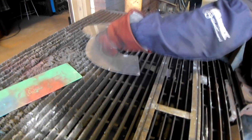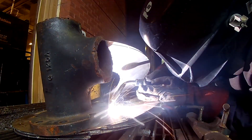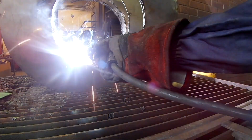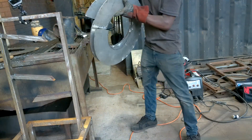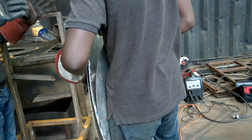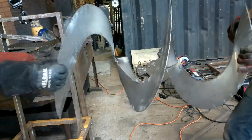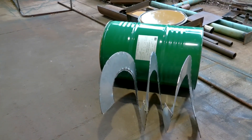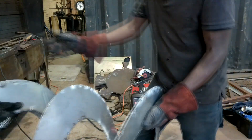At this point I'm pretty much welding all of them together. Once I got all the pieces individually welded up I started putting them together, using an old pipe flange to hold one side up while welding the bottom — this stuff is like a spring, it wants to compress until it's stretched out. I had my buddy help me stretch it; the professional way is probably a hydraulic tool but I've got my own hydraulics — arms, leverage, and body weight. We stretched it out and it came out nice, but it was a little too short, so I needed four blades. I had three, so I went ahead and welded on the fourth blade and stretched it out again.